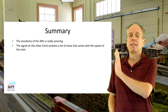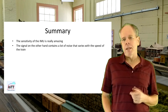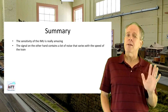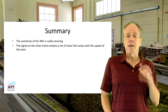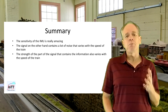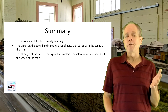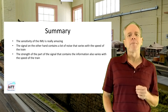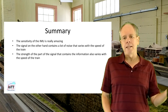The signal, on the other hand, contains a lot of noise that varies with the speed of the train and starts to increase while the train is still several feet away from the hump. So a filtering algorithm is required. I feel relatively good about steps one and two of the process, but steps three and four certainly need improvement — if you have an idea for a good approach or algorithm, please let me know in the comments. The strength of the signal that contains the information also varies with speed, and not only the amplitude but seemingly also the frequency. This makes it difficult to build a filter that works over the entire speed range, so it must be some sort of adaptive filter — that is the next thing I will have to work on.